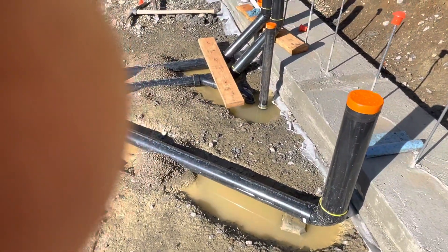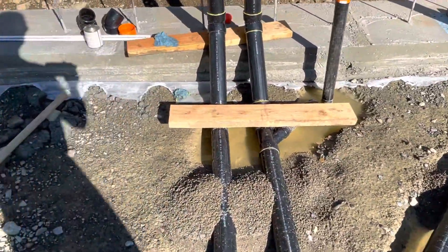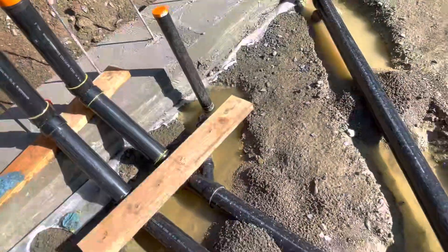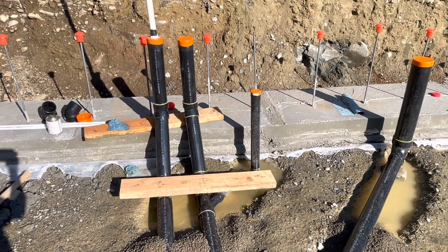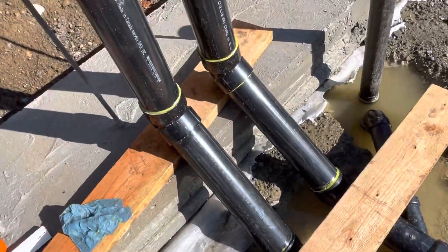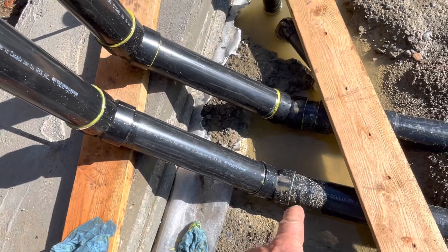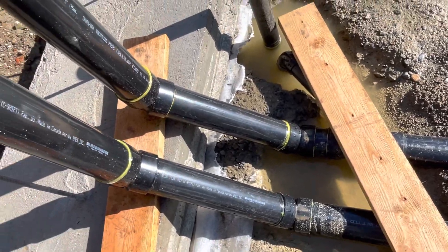The other learnings I had from a plumbing perspective — I kind of did a stupid thing here. I did up my fittings one at a time, starting from here to there to there, and you can see it doesn't align perfectly. I'll be able to bend it into shape — it's not going to affect the quality of the job. But the second time, when I did my riser, I put all this together first and then my final glue job was that piece right there. I had it in perfect alignment at that point, which would have been a smarter way to do it.